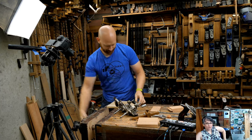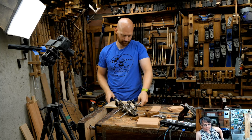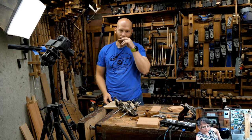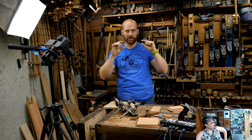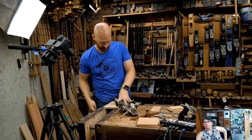Gotta back this up. So, first knot wants to know, should the front panel be cut lower to allow room for the top to slide? We are going to do that later. So we're actually going to cut the groove all the way around, and then that groove will become the mark that we can cut off that front lip. Then we'll take that front lip off and glue it on to the top. So it'll fit in there.